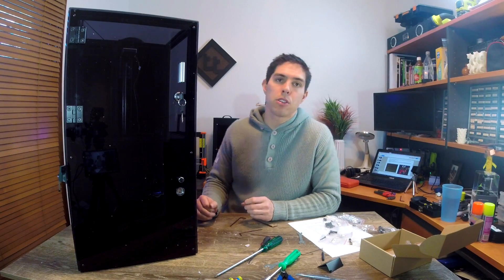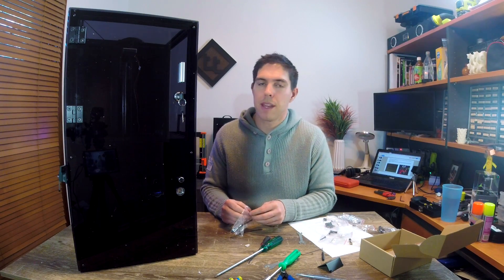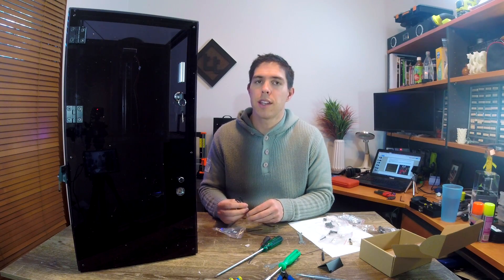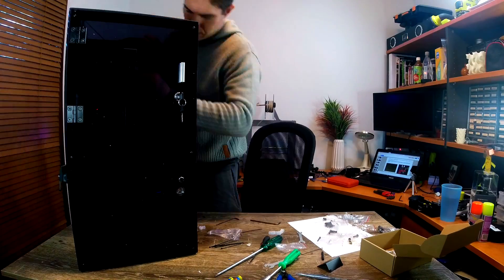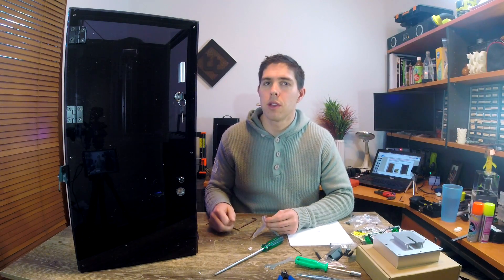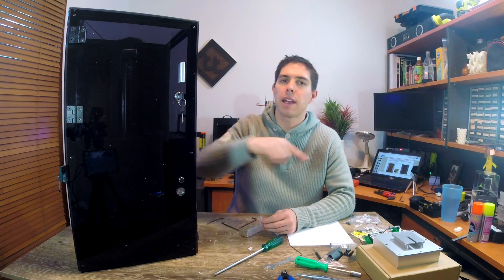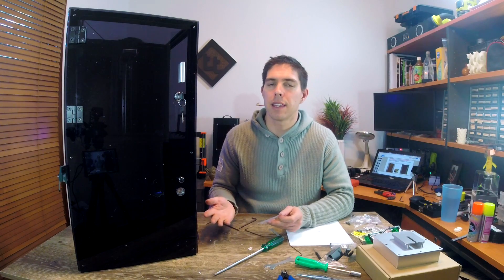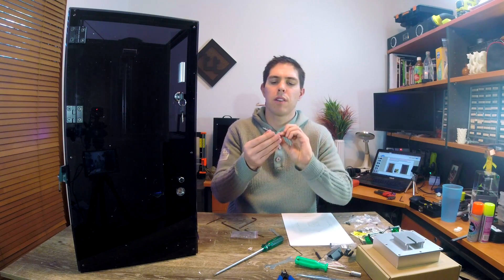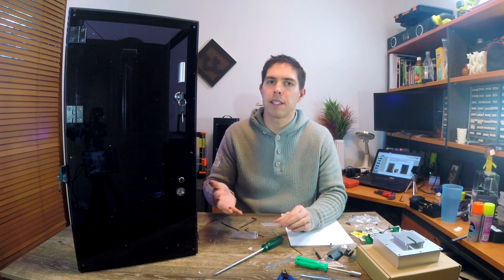Most of it is together at 2 hours 14 minutes and we're up to cable management. I'm going to follow the diagram, get everything tidied up, and then the outside panels go on. Instead of strictly following the image in the instructions, I looked from the top and checked for line of sight between the Galvo, laser module and the cutout for the build platform - if you can't see any wires in the way, the laser can't hit them. I'm now up to this final step before calibration: a small piece of acrylic that goes above the Galvo, with the protective film removed from both sides.